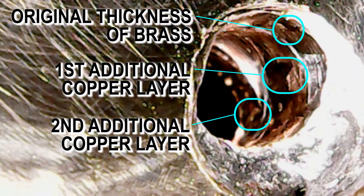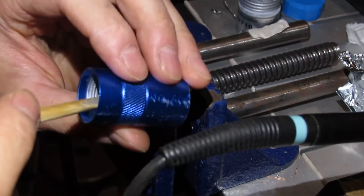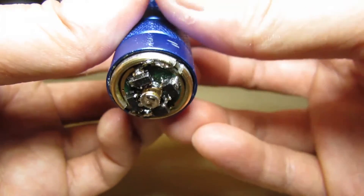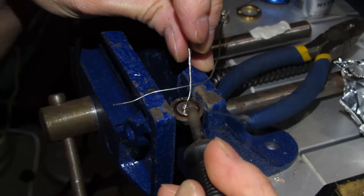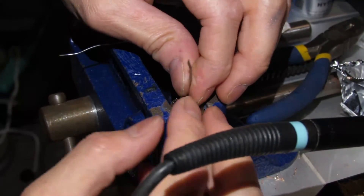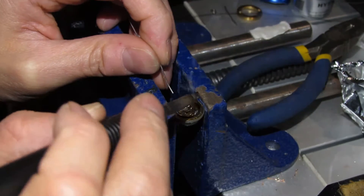If other manufacturers went to the trouble of using a Sinkpad 2, making the brass block stronger, and using a lot of thermal grease on the threads, they could get their flashlights up to 20 watts as well — but they probably don't because it gets too hot and most people don't want that extra power. You can also get extra power through the tail by adding wire braid to the rear spring, but they haven't done that either. The spring is one of the bottlenecks because it isn't made of high copper content metal, so it can't conduct electricity that well — it's quite high resistance and you lose a lot of power there.